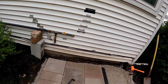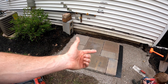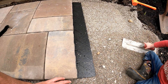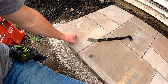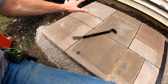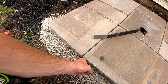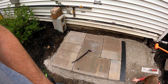Now we're ready to set pavers on there. It doesn't need to be a fancy pattern — just some Beacon Hill pavers we had left over at the shop. I don't want to do any cutting. It's total overkill for this project, but it's going to be a super sturdy, elevated base for the generator. I'm going to cut the excess fabric off with a razor knife, then run masonry adhesive — concrete adhesive — and glue down the outer edges, lifting up the corners to adhere them to the geosynthetic base mat. I'll also apply polymeric jointing sand and tape the edges to keep it restrained.